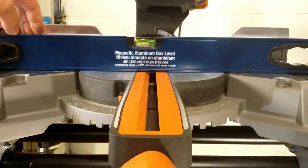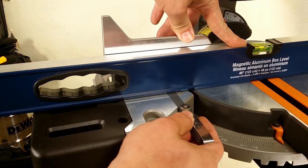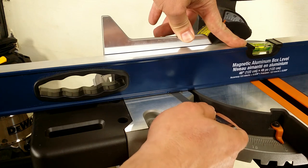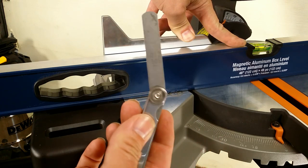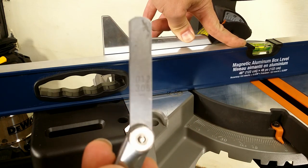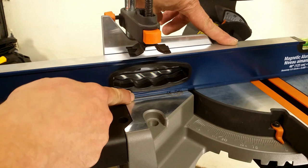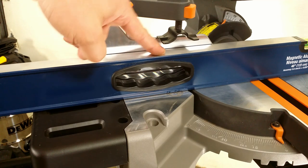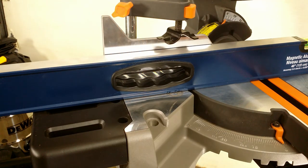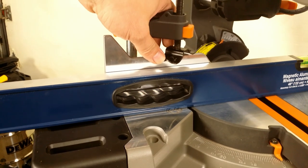On the left side, well. It is lower by 0.012 of an inch. When you press down the piece that you cut here, it will be off the right angle here. The problem is that this clamp works only over this lower table, and holding down the object, you tilt it at the blade.